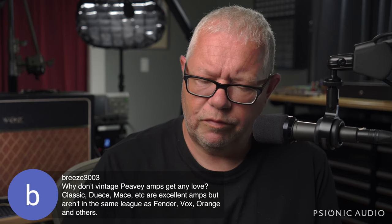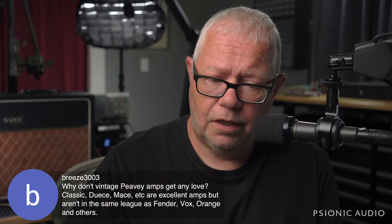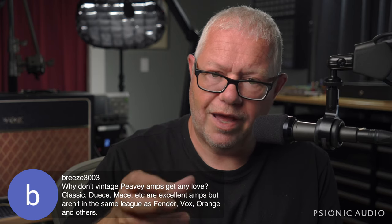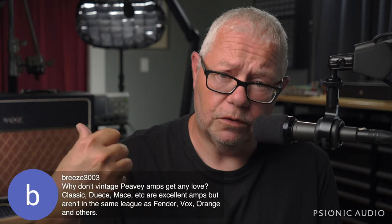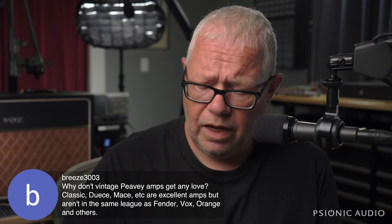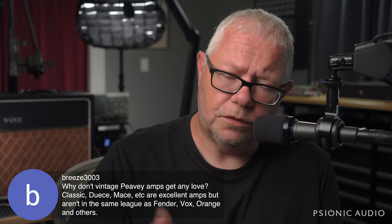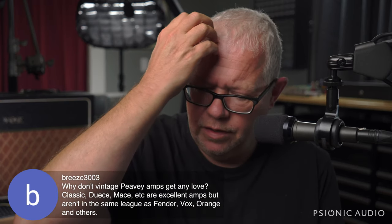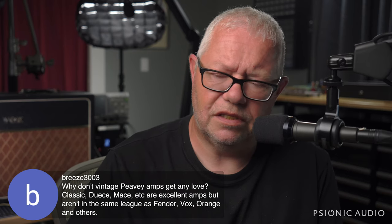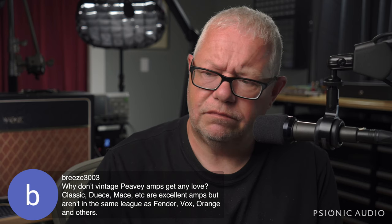And then in the later 70s, I'm not sure the precise year, and maybe different models changed at different times, they went from having a baffle that had the grill cloth on it to having a baffle and then a frame with the grill cloth on that, and that frame was just Velcroed, industrial Velcroed, to the actual baffle. And in the smaller amps, you lose cabinet depth as a result, and that frame always warps and it buzzes because the Velcro comes loose. It's just generally crappy quality.